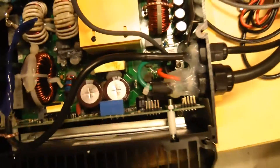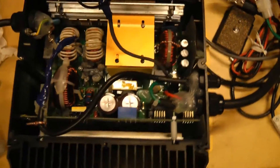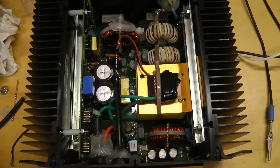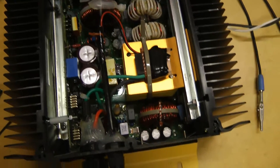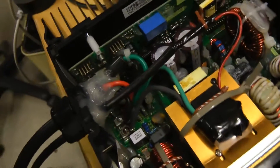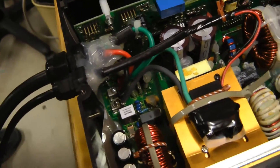I'm also going to have to hook up the charge enable line J18 to a relay so the BMS can close that to turn on the charger, connecting it to ground. That charger mod is done — I just added a relay to switch the remote enable or temperature sensor line.